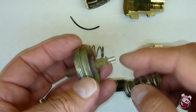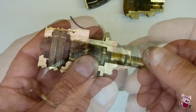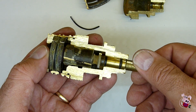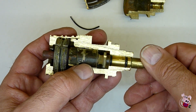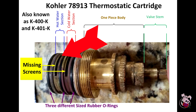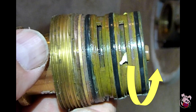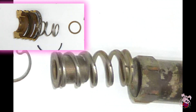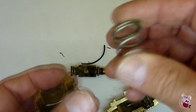One theory would be that the ring wasn't floating right. If there was a piece of rubber over the end of the center shaft making it just a little longer, when you turn the knob all the way in it would push the mixing valve further over the hot, reducing the hot. If a piece is missing and the center shaft is now too short, you can't fully cover the hot — and the hot chamber is the furthest one in the valve. Another possibility is that the last outer O-ring was no good and was allowing hot water into the main chamber without going through the valve. Keep in mind this valve is always on — it never turns off, it's just mixing. I also checked whether those springs were thermal springs like in a car thermostat — I put them in boiling water and they didn't change size, so I don't think they are.